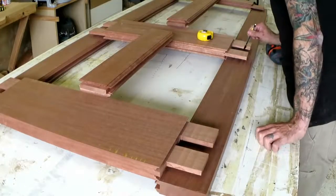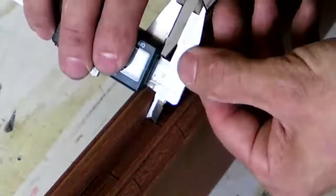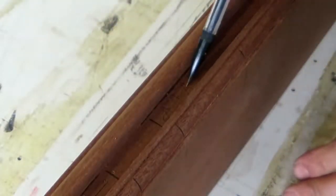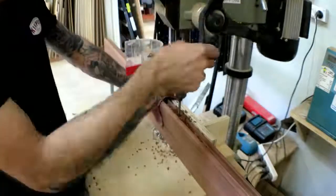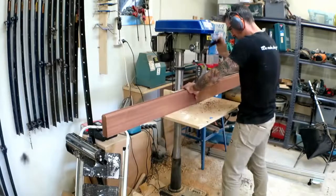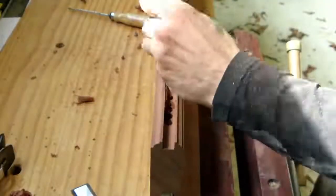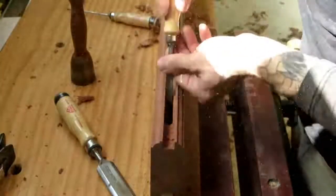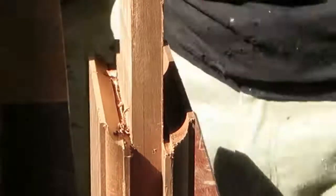With all the pieces cut and moulded, I can mark out for the mortises. I was planning to use my benchtop mortiser but it wouldn't go deep enough the way I wanted to do it, so I ended up just setting up my drill press and drilling a bunch of holes. Then I spent the better part of a day cleaning out the ten mortises. Something was off by about half a mil with the coping bit, so I had to trim out inside the coped area — ended up having to take quite a bit out just for the size of my 4mm chisel.